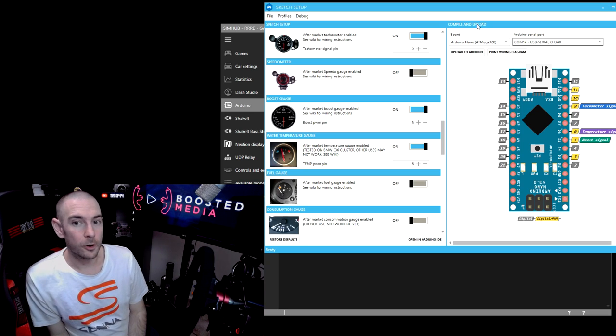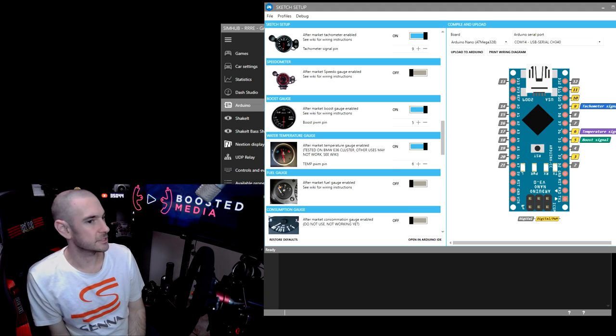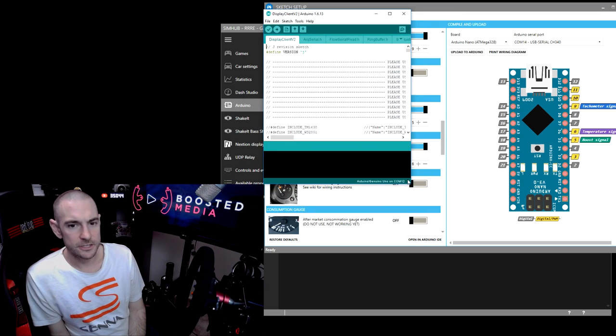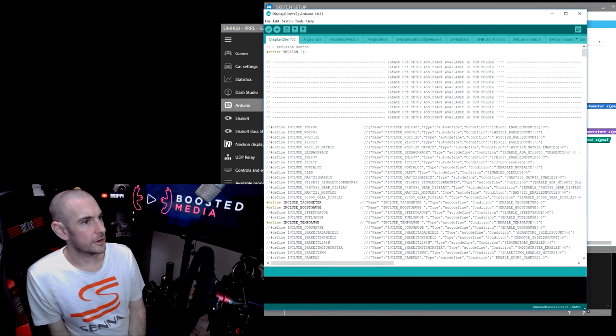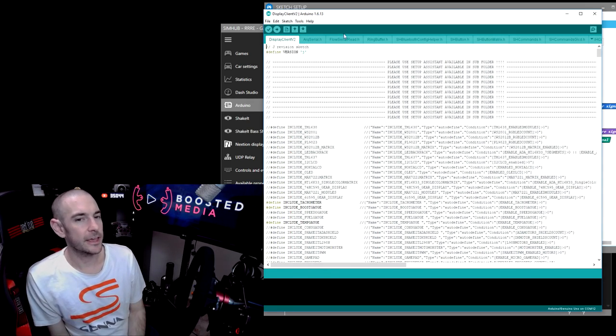Now, if you do have any problems with it flashing, sometimes you can get errors. What you need to do is click on open Arduino IDE. And what that'll do is open the Arduino IDE software independent of SimHub and it preloads the sketch. So I'll drag this over for you to see as well. So you can see here, this is the sketch with all the various code and everything in here. So if you do have problems flashing it directly out of SimHub, you can go into the Arduino IDE and flash it from there. You may find that you also need to install the Arduino IDE to get this feature to work properly. So I'll also provide a link in the description to download that as well.